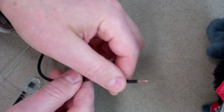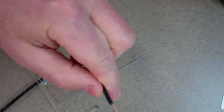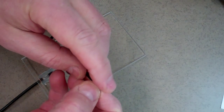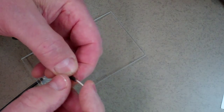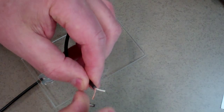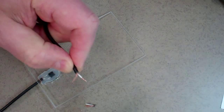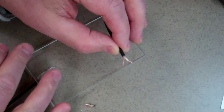Once you get that cord, go ahead and cut it in two. That's going to leave you with an end that you're going to strip off. I'll just re-strip this one to show you how easy it can be — you'll have an end just like this. Then use your wire stripper carefully, since it doesn't quite fit the size here. You're going to have these wires and you're going to separate them. You have all these loose copper wires — separate those loose copper wires the best you possibly can. Even one little extra strand of that copper, if it touches the other side, that's enough to short it out. So you want to make sure you get every little piece of exposed copper, and then twist them up and form a wire out of that. The other section has the white insulation — you want to take about half of that off, leaving you with that configuration.